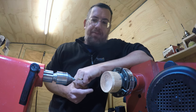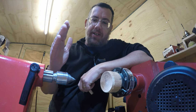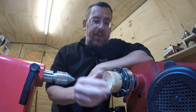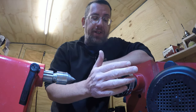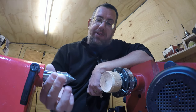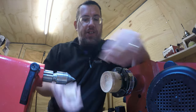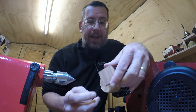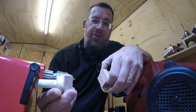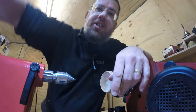Morning, Paul here. Before I start on my next project video — you'll have seen in the last project video that I was using the tailstock to push the pens together. It was a bit cumbersome. I've now got a couple of small pieces of hardwood which I just sink straight into the chuck, and another piece that goes straight into the tailstock. It is a lot easier, so just a quick tip on what I've changed.